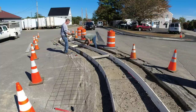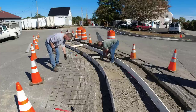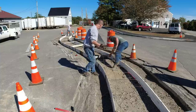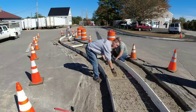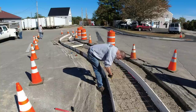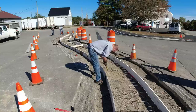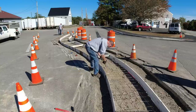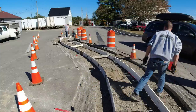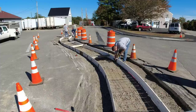They call this six-six-ten-ten wire mesh. They have a heavy gauge and a light gauge — this is the lighter gauge. It comes in a five-by-ten sheet so we had to cut them in half. We also had to shape the wire a bit because we don't really want it touching the edges, so any part touching the edges we cut back two or three inches. Those little wire cutters work really well for cutting the light gauge wire — they make cutting it really easy.